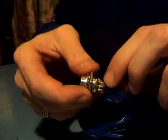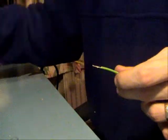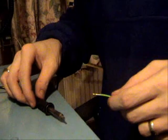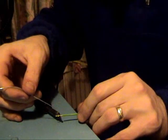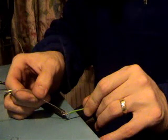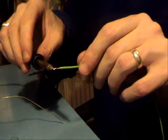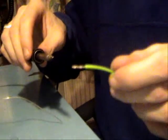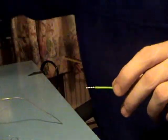Tin your wire before you start. All it means is taking your wire, taking a soldering iron - try not to do it like this - apply some heat. The soldering iron is the wrong way around, but just put a tiny, tiny amount of solder on there, which is not a lot. If you hold the heat and give it a little flick, it takes the excess solder off, but you've still got a residue on there so it makes it easier to connect the two.